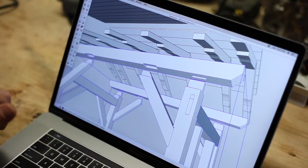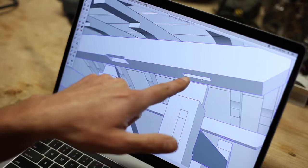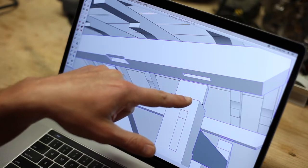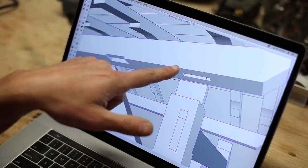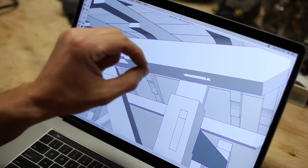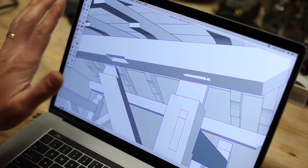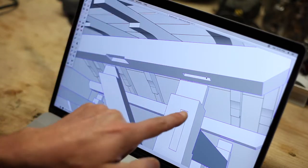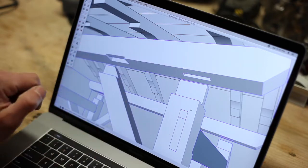These here are the wall plates that we're going to cut. Let's look at the joints and figure out how they work. The tenons on the top of the posts are centered, so we just have a mortise that is a little bit deeper — I think that's just over four inches — and it's centered on the beam. If this wall plate happens to be too wide, we're going to reference off the outside of the post, because when we put siding on we need the outside surface to be flat. So I'm going to make sure that this surface is flush with this surface.